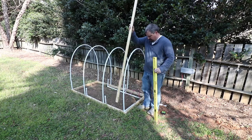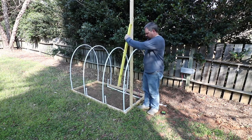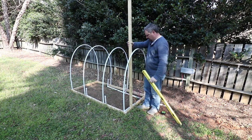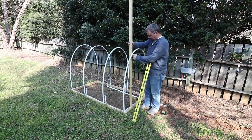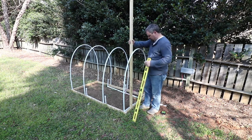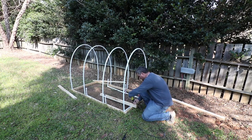Where I made those 8-inch marks, I'm going to put this piece of lumber here, check that it's roughly straight up and down, then mark this on the angle of the PVC and make my cut right there. I'll do that on all four pieces — four uprights, one on each side of each end. Then I'm just going to screw these boards down to the frame at the bottom, right through the edge here.